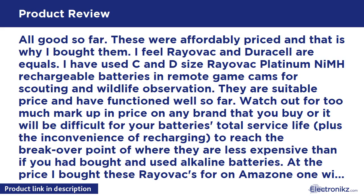I'm not using a solar recharge panel on any camera. I recharge to 1.4 VDC finish potential on each cell, rated at 1.2 VDC, and the cameras shut down when a cell reaches 0.9 VDC. These values and my method are offered for educational purposes only and do not constitute a recommendation — follow manufacturer recommendations in your own situation. Your individual experience with a product may vary.